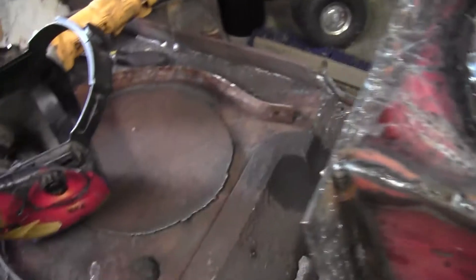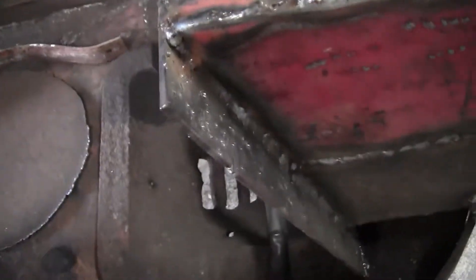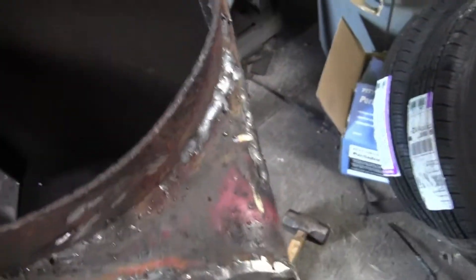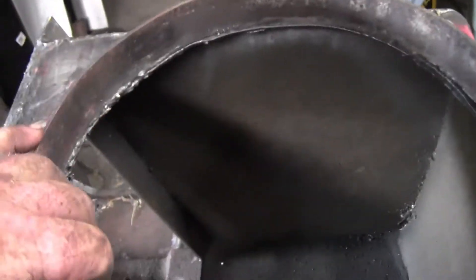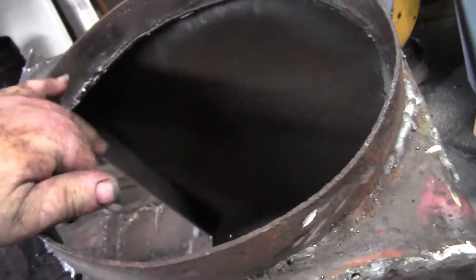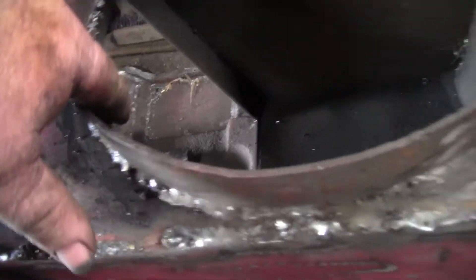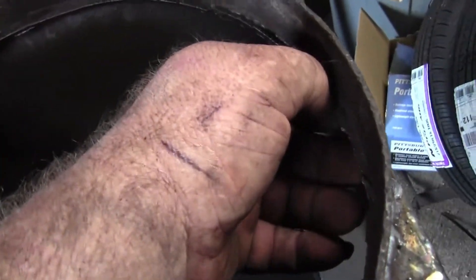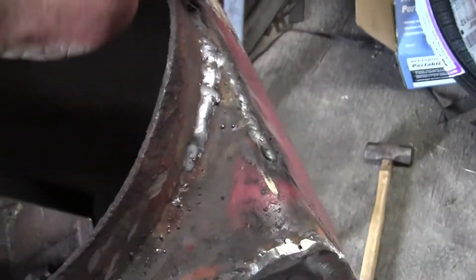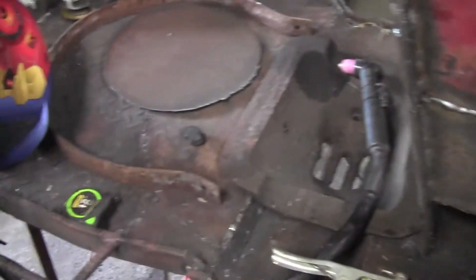For the top, I had a couple of pieces I used to hold a keg in my Ranger when I had a keg for the gas tank. I just kind of reshaped them, welded them to the top of the hood, then cut the circle out with a plasma cutter — the plasma cutter did a pretty good job. I kind of monkeyed up here trying to trim off some more, and I had double wall thickness here because I had a gap in the back.